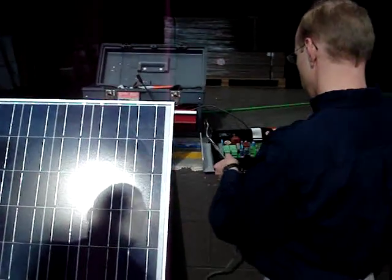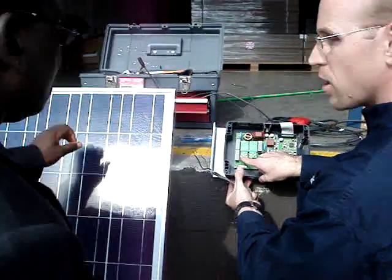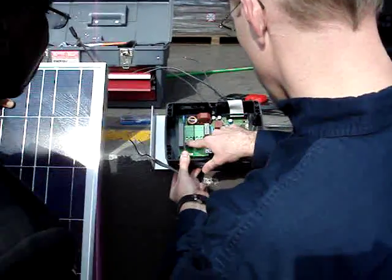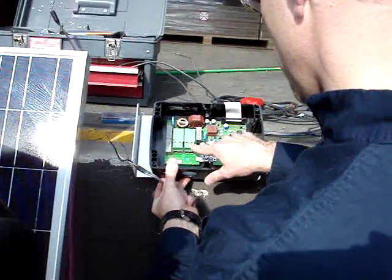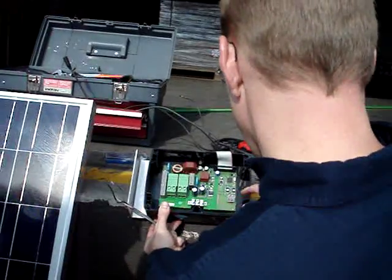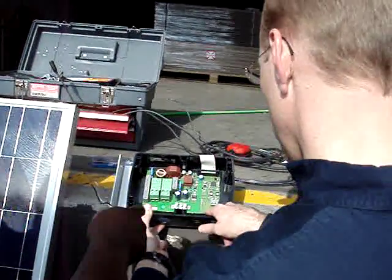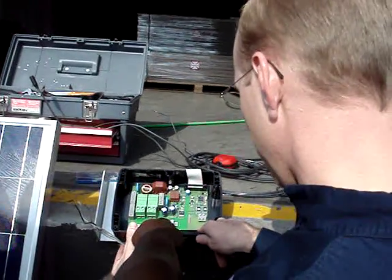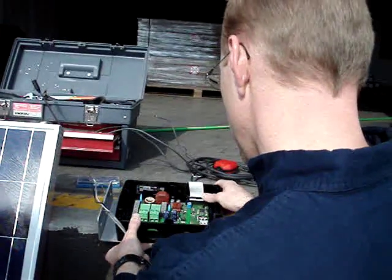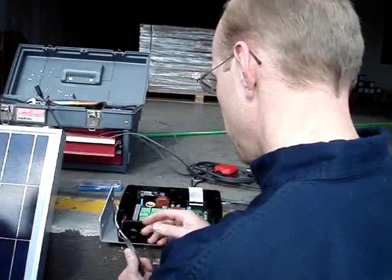The pull box is open. It's clearly labeled inside of here. Power comes into here. Pump comes in here. The pump goes right there. Our float switch is going to come in right there. We're going to use one of those on our ground right here. It's a bus bar — a grounding bus bar.